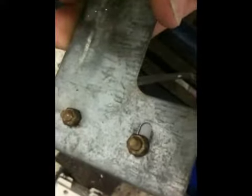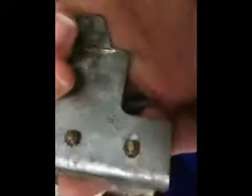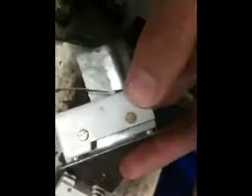We're going to pan out and flip this over. Here we have the back of it, and you can see there's an adjuster space area here. Usually we set it to the closer top area or right in the center here, and that pretty much sets the default setting for the microswitch. This is a new microswitch assembly going to go back into the machine.